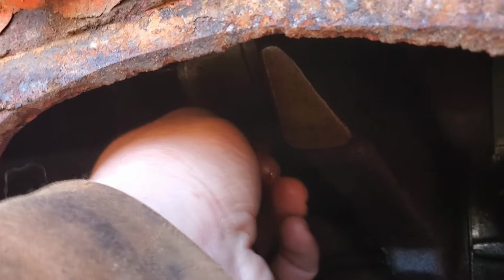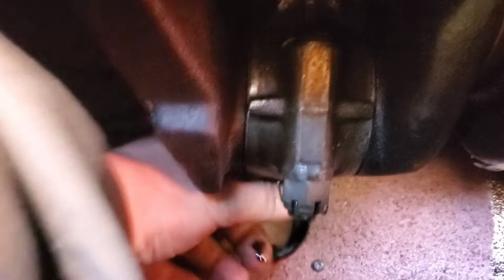There's a little bit of water there, actually. What that looks like. Oil pan's really spotless, though. I'm impressed how clean that is. So, cylinder one. A little bit of play. Not too bad. These were Babbitt bearings. That's front to back. Side to side's almost nothing.